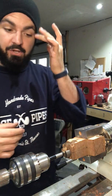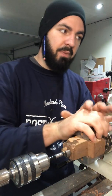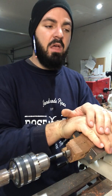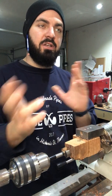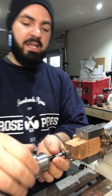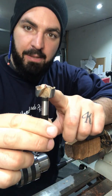And then once that's locked in, depending on the drill press you got, if you get a fancier one, you can if you want. This is a budget build, so try to keep it as cheap as possible. The actual table that you drill on should be able to swivel left or right, full circle, 180, so you can leave it locked in. And then you want to take your Forstner bit that I got you guys to get, because your Forstner bit has this really nice tip on it.